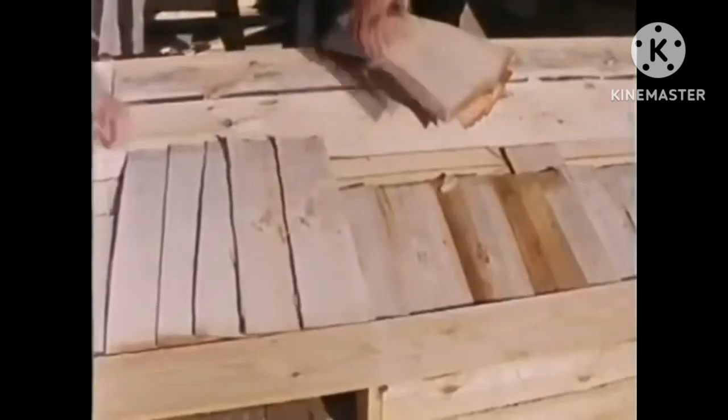A normal shingle roof is thoroughly threefold. The first shingles are short, one-third of a full-length shingle, and the second layer has only half-length shingles, and the third layer is only full shingles.